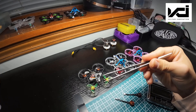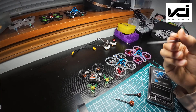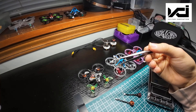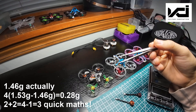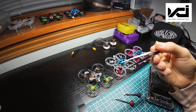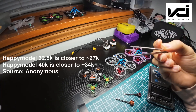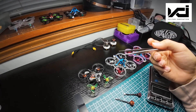But the V1 Spark motor wasn't perfect and there were two downsides. The first downside was that it was a little heavy — the version 1 weighed about 1.53 grams with cable and plug, which was on the heavier side compared to the Happy Model OEMs with bushings at about 1.47 grams. That's an additional 0.07 grams for the dual bearings, adding about 0.28 grams to your Tiny Whoop in total. Secondly, it also wasn't the most efficient motor, especially because the 29K KV was accurately stated — unlike many other manufacturers who overstate the KV value. So it was common to get about one and a half minutes of flight time, which is good enough for three laps on almost any track, but not the best.